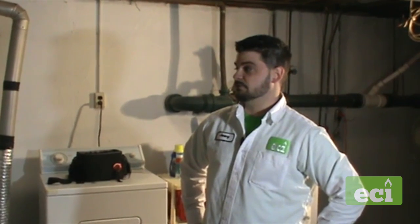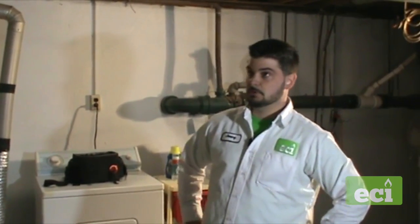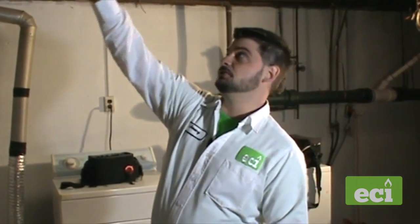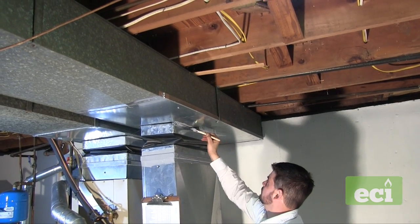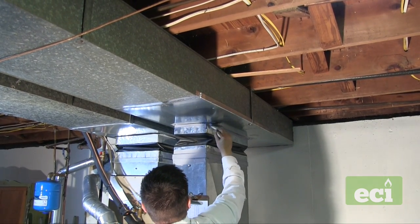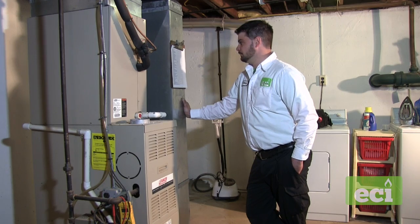When we're done the tune-up, we'll give the customer a full checklist of what passed, what failed, and what our readings are. I would tell them before taking the static pressure of the supply, they'll need to have us repair the duct leaks first so we can give an honest reading on the supply. I would also recommend using duct seal on each one of these cracks — there are significant gaps in the supply and return where they attach to the old ductwork.